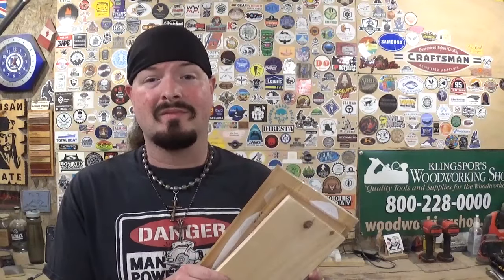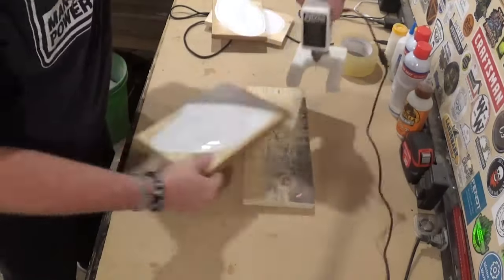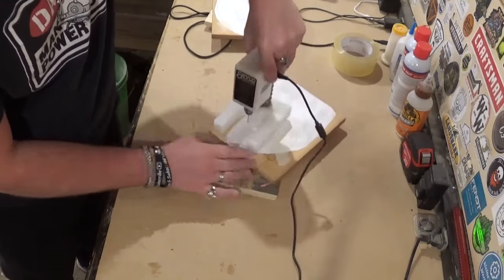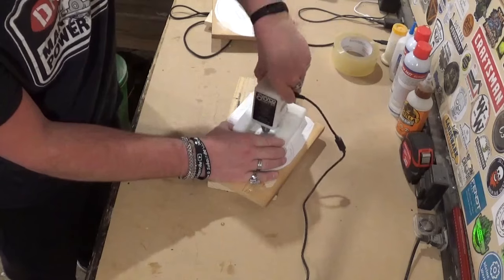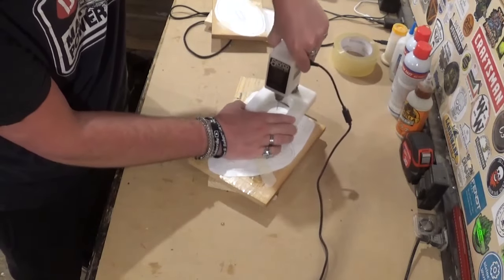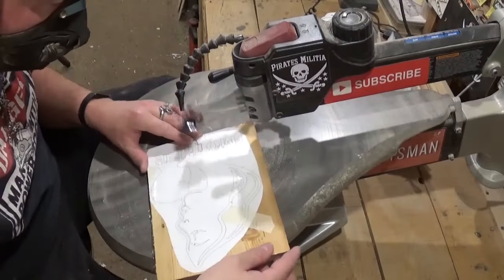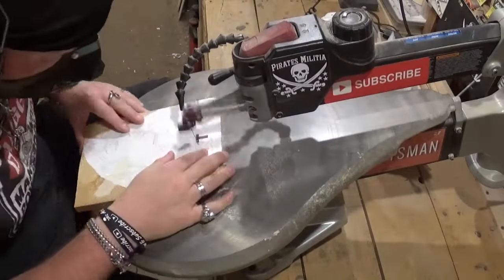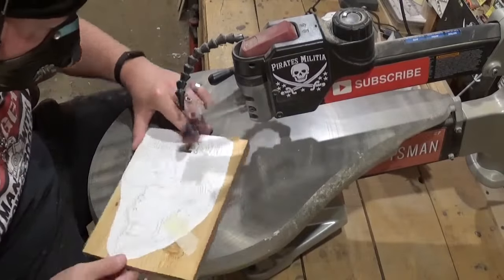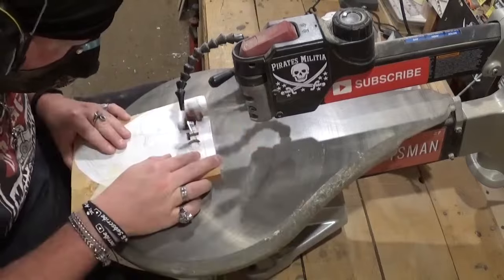All that's left to do now is drill all of our pilot holes, so let's move the camera and do that. Over here on the workbench, we'll use the Seyco scroller's drill to drill out all of the pilot holes for internal cutting. I have a backer board behind the scroll work to prevent blowout on the reverse side, which helps us find them easier at the scroll saw. I'll use a number five ultra reverse tooth scroll saw blade — it will cut through the pine exceptionally well with minimal chip-out.